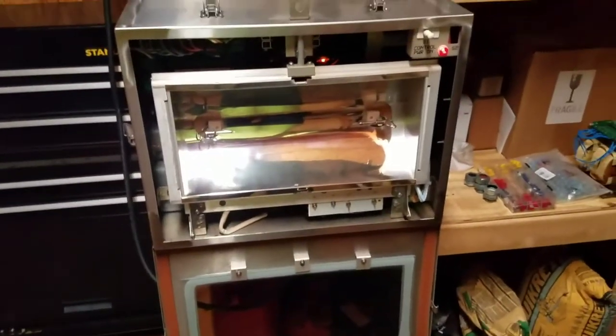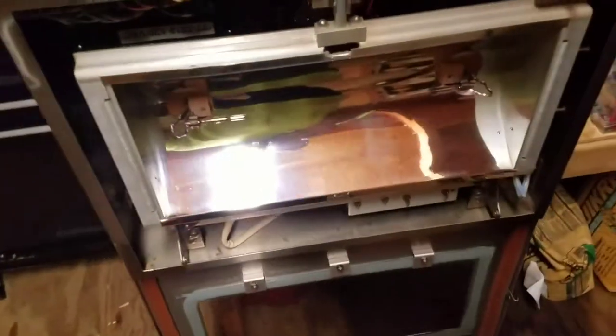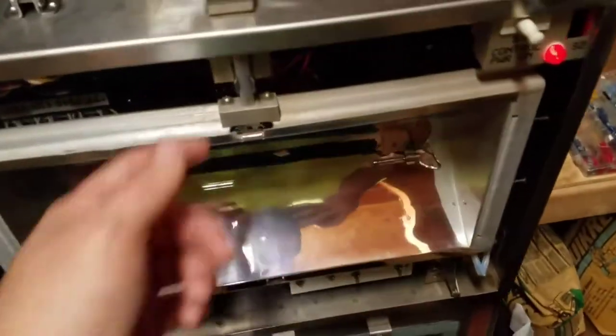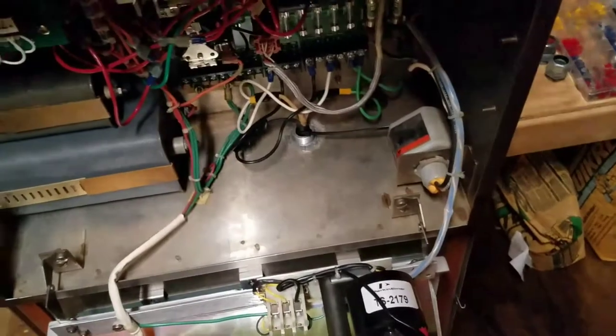Now I know what you're probably thinking — I know it's not flashing at the rate it's supposed to. That's because I don't have a sync timing signal. Right now this flash has gone into what's called self-oscillation, which basically prevents it from going into a runaway situation where it just goes into an uncontrollable flash — or at least where the trigger transformers are going non-stop or something like that.